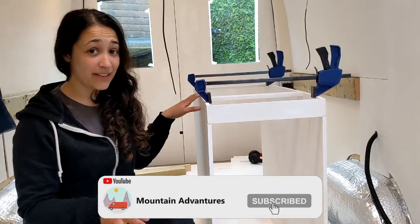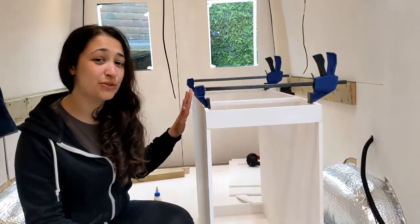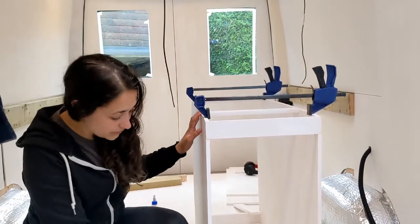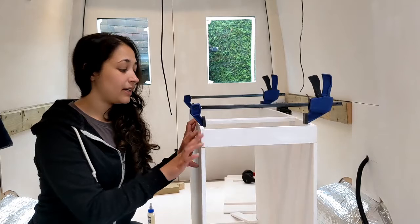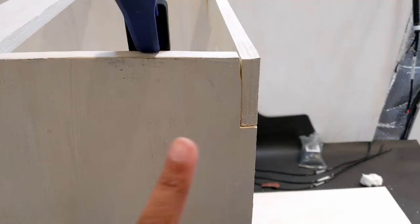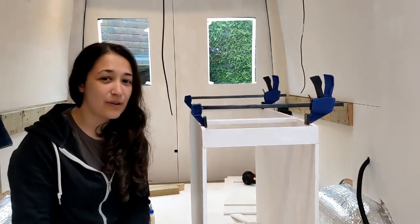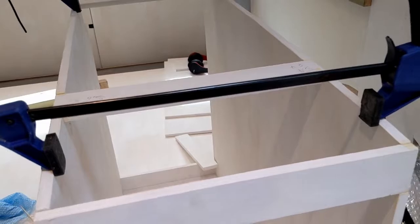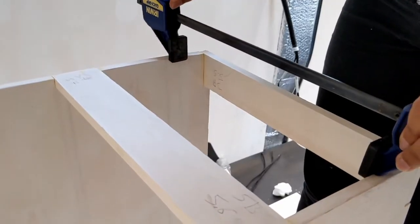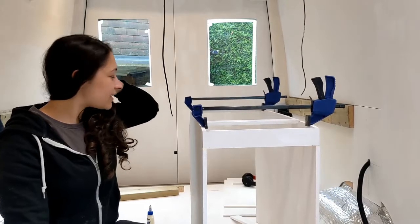We've started to build the first of three kitchen units — this is going to be the longest piece. We had a bit of an issue trying to clamp it all together and keep it square. The bottom was easy enough using a band clamp around the corners, but we only have one band clamp and the upper pieces weren't supported on the sides, so the ends kept bending in and going off square. We fixed this by popping the clamp on the inside and lengthening it until the unit reached the right width, so the clamp pushed the side walls out and held them in the correct position.